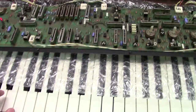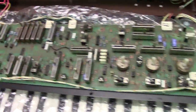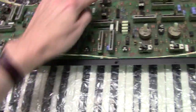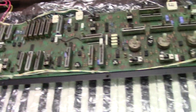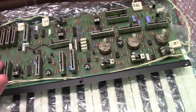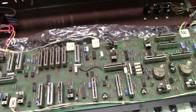You can set the octave to 16, to 4, or a mixture. Looking at the front panel: it's 16, 8, and 4. You can route the filter to the organ as well. So that's going to the organ, then you can pan it back and it'll just be the one note. Basically all this is just a chain off those dividers — that's really all it is.